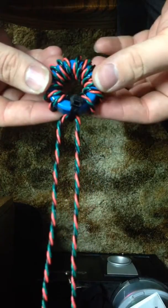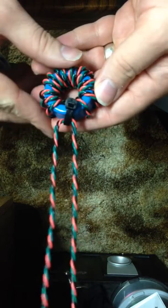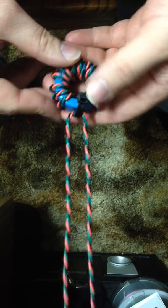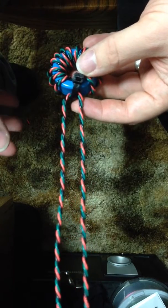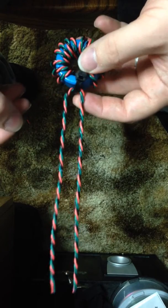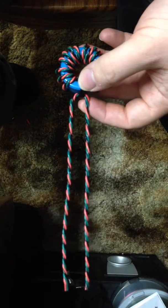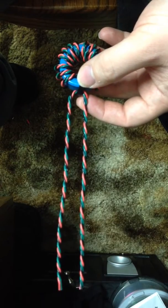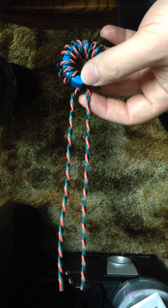15 turns — clamp it down with a little zip tie so it stays on there nice and neat. And then this is basically how you do the phasing without an oscilloscope. It's very simple, but it can easily get mistaken if you don't label it. So we're going to take a little bit of tape and tape off the quote-unquote positive ones. Obviously it's a non-polar device, but thinking of one side as positive makes it a bit easier.